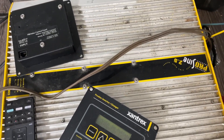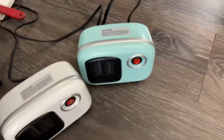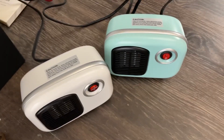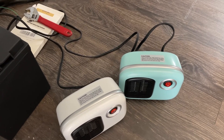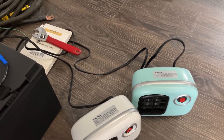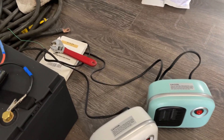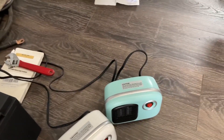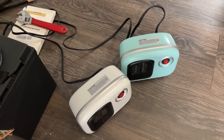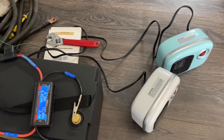You can change the charge amperage setting inside this inverter, but I'll save that for another day. What we're going to do is turn the inverter on. Over here I have two little space heaters — I believe they're 300 watts each. I'm going to turn them on one at a time and see how close we can get to 600 watts. This should take about two hours for this particular test. The other test was 80 watts and took every bit of 12 to 13 hours, but it did pull the full rated wattage out of this battery.